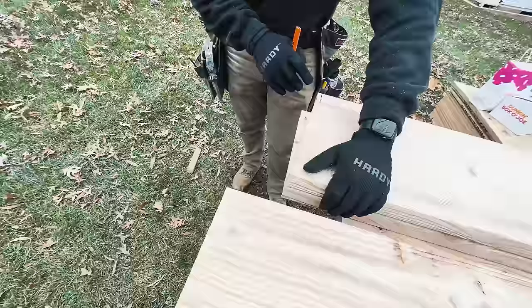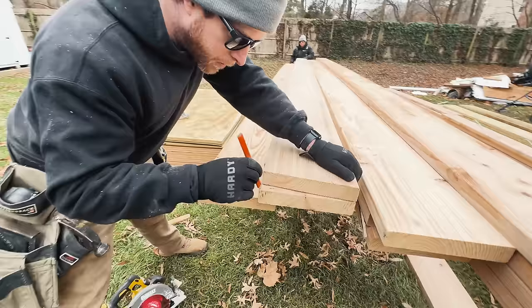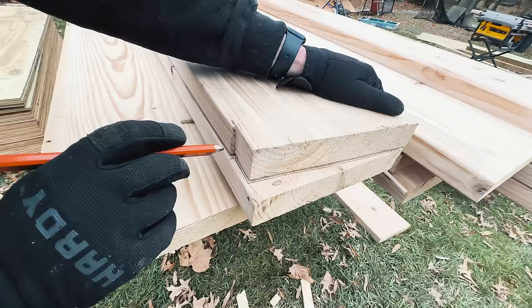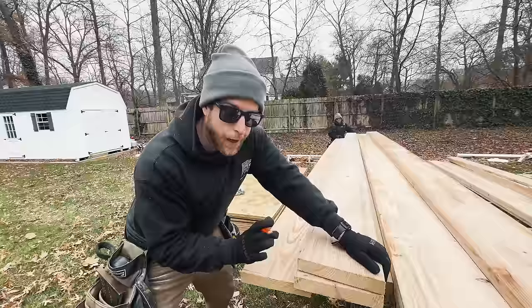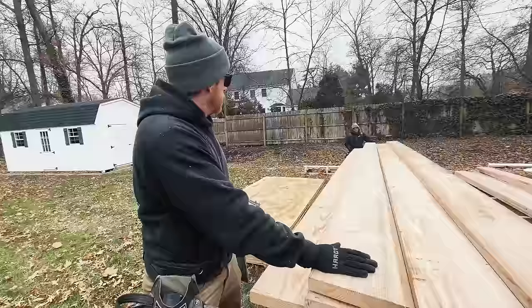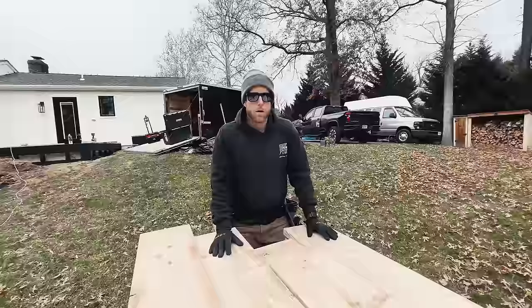All right. Here's the only other thing that we had to do. Here's our ridge cut. Come around here. We just have this tiny little notch right here. That's gonna be so our hanger fits in there real nice. We don't want it just barely on there and coming in at an angle. That's hackery. We don't need that. All right, you good? You traced it? Okay. All right.